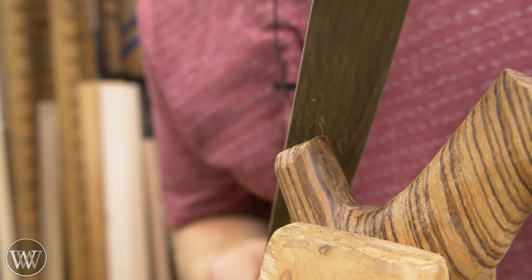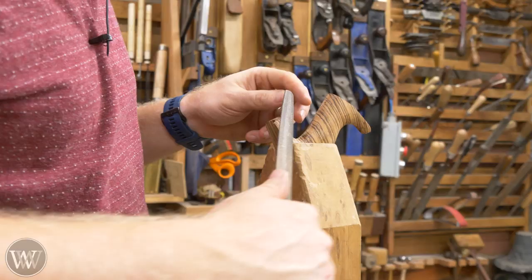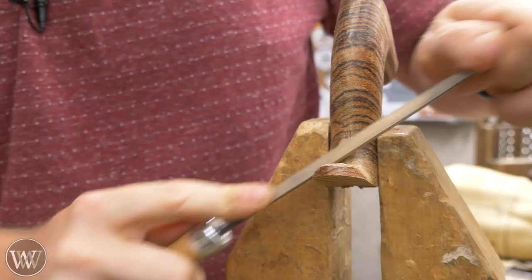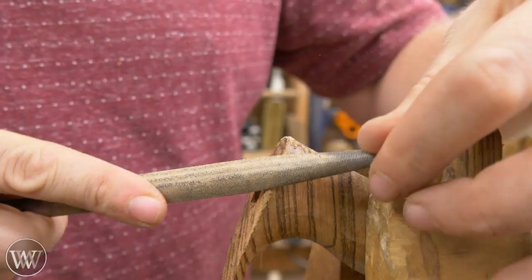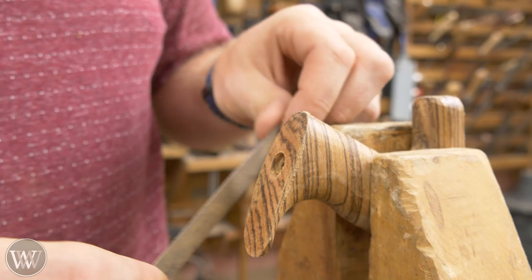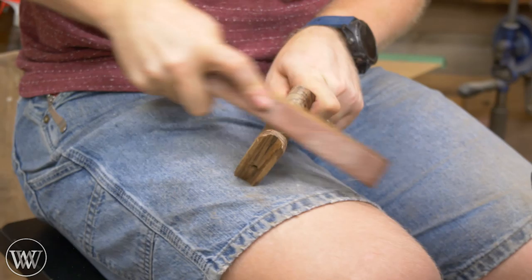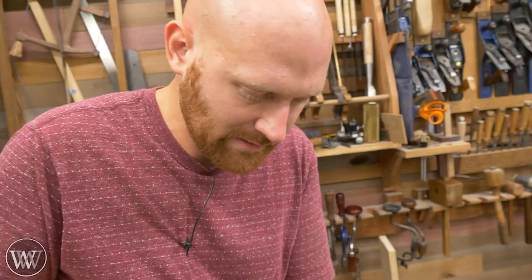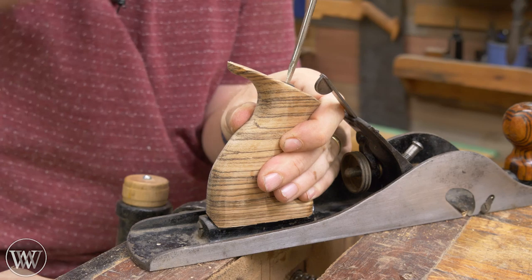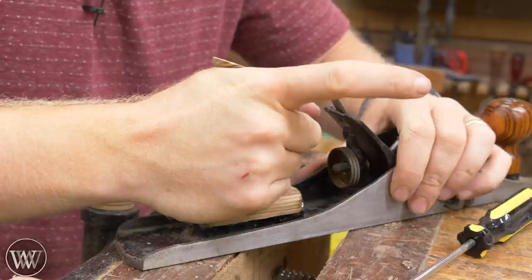Come in and do the last little detail — rasp, file, finer file, and really fine file — and you get that nice clean rounded edge all the way across. We can do our detailing work, clean up the top from the saw marks, and then break all the little edges just a little bit to give you that nice clean feeling. It is amazing the sharp feeling you can get from a file that sandpaper just ruins. We're going to come in and do a little bit of detailing with sandpaper — not to fully sand it, but this lets me see where I still need to work. Any scratches that I'm missing will be filled with sanding dust in the pores, and I can come back and clean those up with a file. The sanding lets me know where I need to file more. Now that we have it all cleaned up, we can give it its final test, feel it in the hand, and make sure everything is running smoothly.